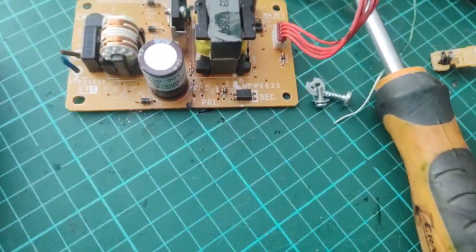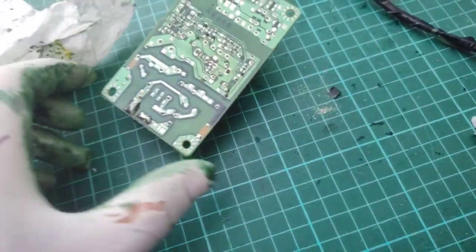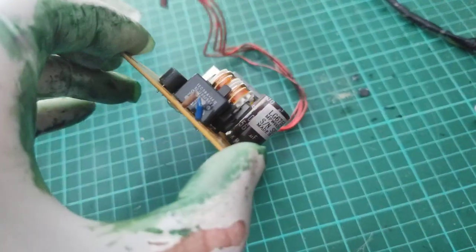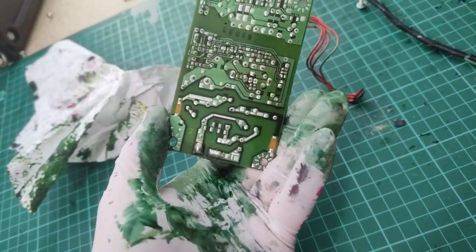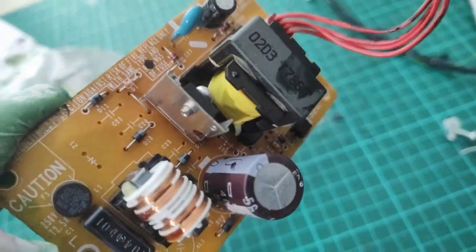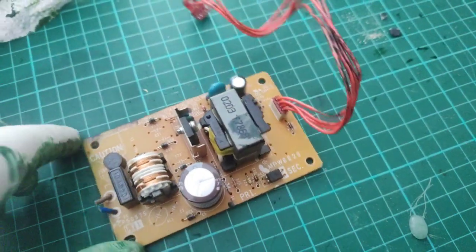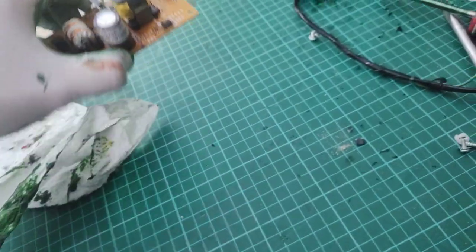So it's isolated — where is our main chip? I don't see one. So how is this switching? I do not understand. Might have to look at that closer later. It's not unless that's the bridge rectifier — it's not unless they've got a discrete bridge rectifier, which could be possible, but I find this curious. We will look at that later — we'll put that aside.